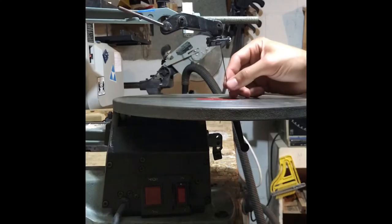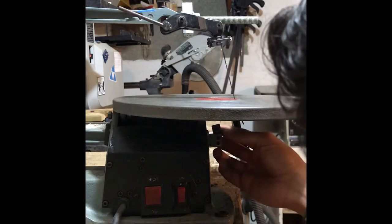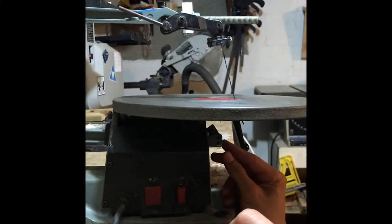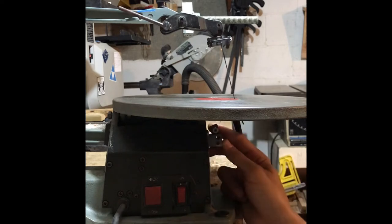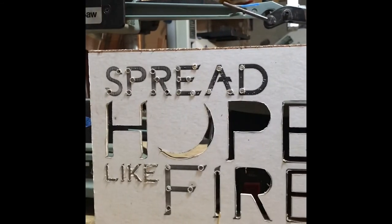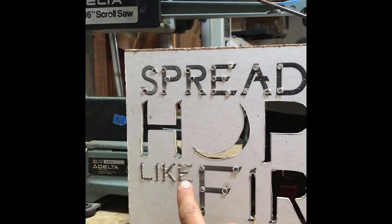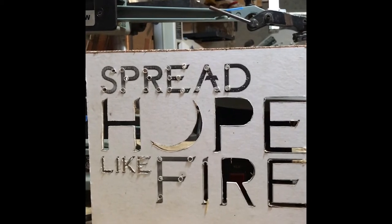Last time it just completely flew off, but I've just got to work on this lower blade tension to make sure that everything is good down there and that it would actually stay. Maybe what I could do is stick the locking nut on there as a fail-safe, just to make it doubly secure. Because that thing loosened up like a good sixteenth, if not an eighth of an inch, just from that test run. This thing will not just be drill holes — it'll actually be something cool.